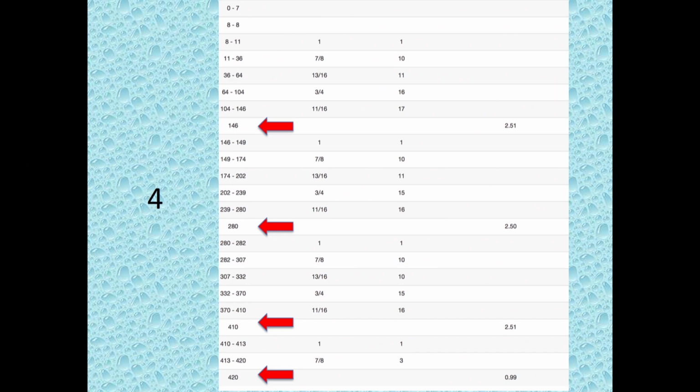I've got a grower I had dinner with last night here in town, and he put 52 half barrels under his run. And the system that we designed for him this year only called for 7 of these 2.5 foot inclines. He had a 16-foot fall from his riser to the bottom of the pipe. Well, that's amazing. That's a lot of incline. And he was tickled to death that he put 7 instead of 52 half barrels.